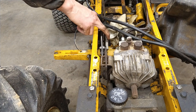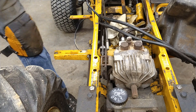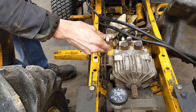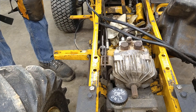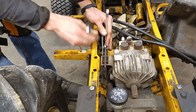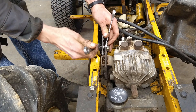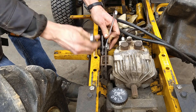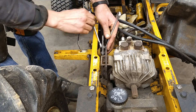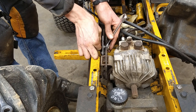First thing I'm going to do is remove the control rod here. Looks like a half inch, probably 7-16 on the other side. And then once we get all this stuff back together, we'll adjust for neutral before we put everything back together, because everything's going to change. Once this stuff gets tightened up, the lever will be — we might get lucky and the lever might be in the right spot, but it's highly unlikely at this age that it's just going to magically be in neutral when we replace this stuff.